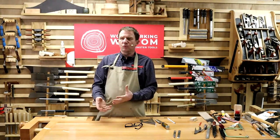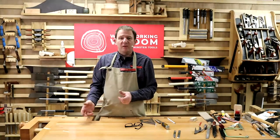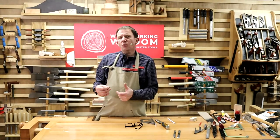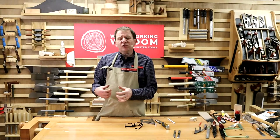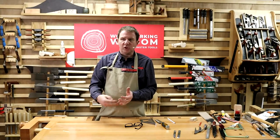Fantastic to do. You can leave some water in there, you can soak them, you can get them out as you need them. If you want to dry them out, put them in 5 minutes before you're going to use them. You'll see them almost bubble, little air bubbles come out of the stone. It will soak the water in quite quickly, and they'll be ready to use. Doesn't take long to soak them. Spray them with a spray bottle to keep them damp and flush away that material.